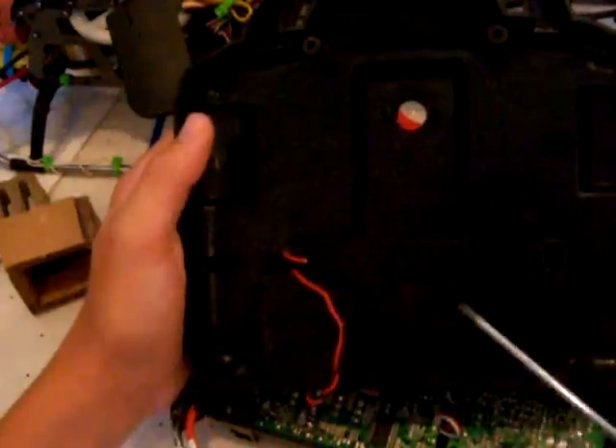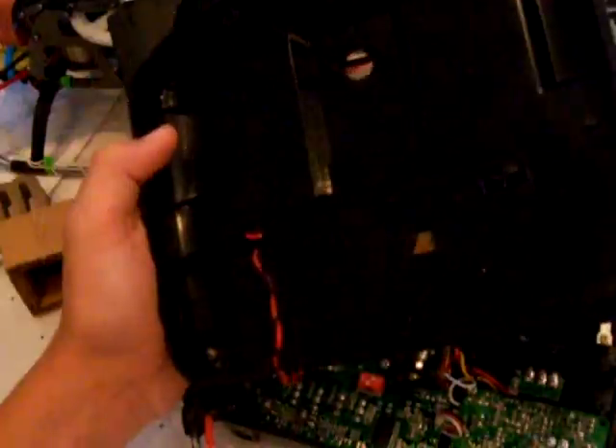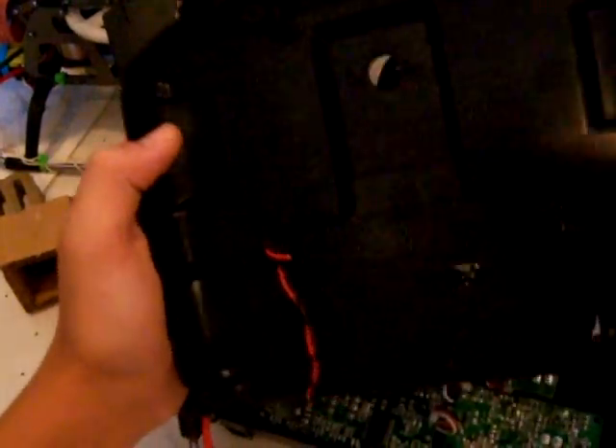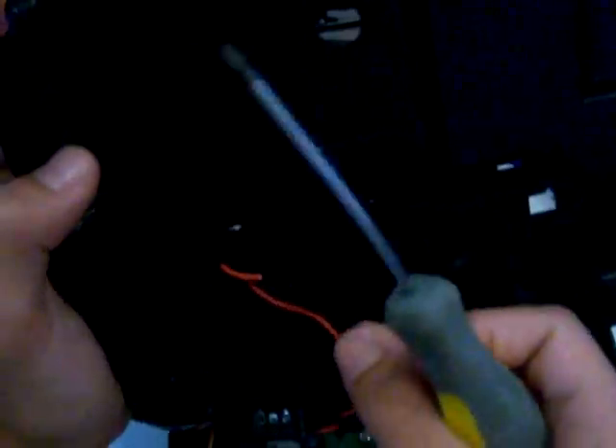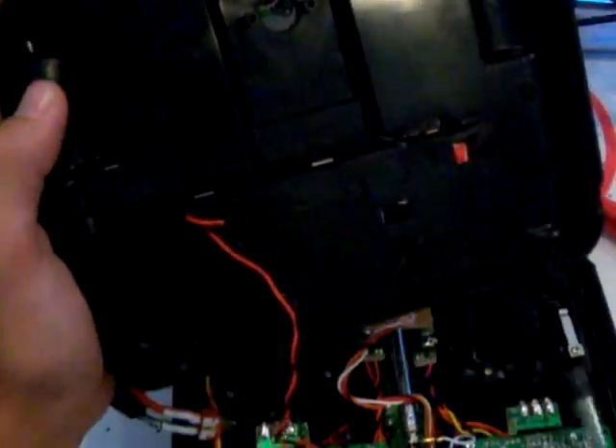Here you can see there is a red wire cut from here, and then there is a black wire that I cut over here. There's a little tiny black wire sticking out — right there. What I did was I cut those two wires, and I took what was left of them, from this thing going all the way up to here, and I soldered them to a Dean's Connector. Then I ran it off an 11.1V LiPo battery. And that's how you do that.